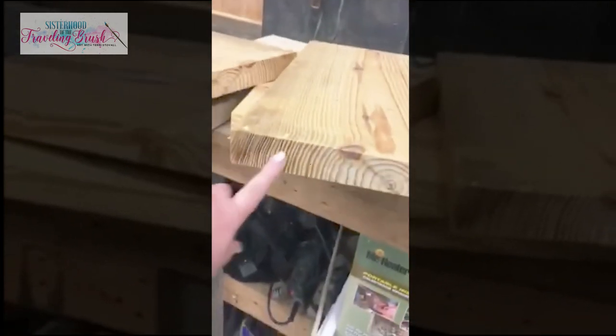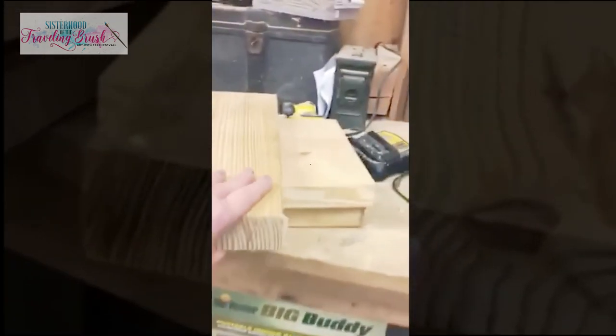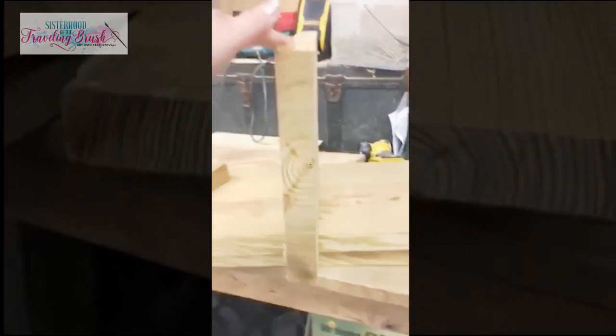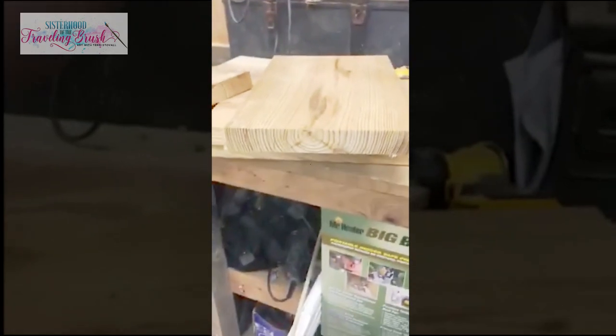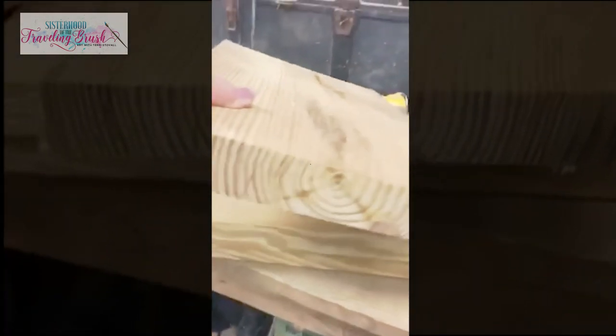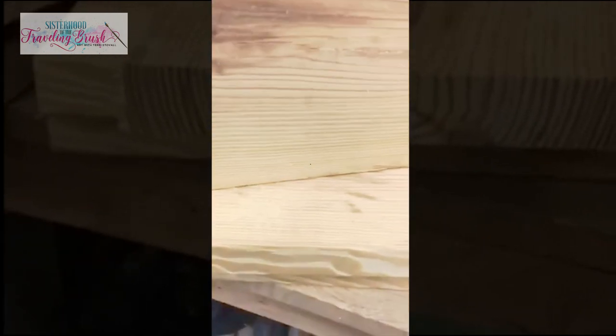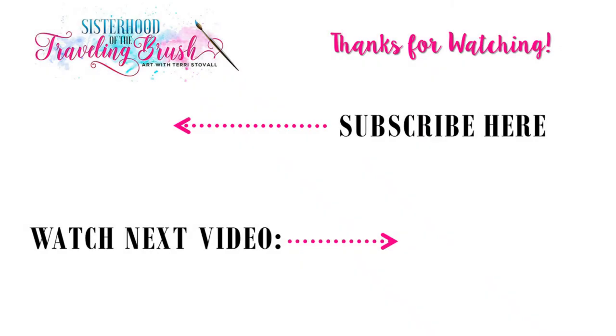That's it for today. If you go to Lowe's or Home Depot, they will cut these for you — just go and pick out your board. Remember your quarter sawn parts, remember to check that it's not bowed, warped, cupped, or cracked in any way, and then decide how long you want them and have them cut. The reason we're going with a 2x12 where people usually go with a 1x12 is that the project we're working on is going to sit up on its side. Thanks for watching.